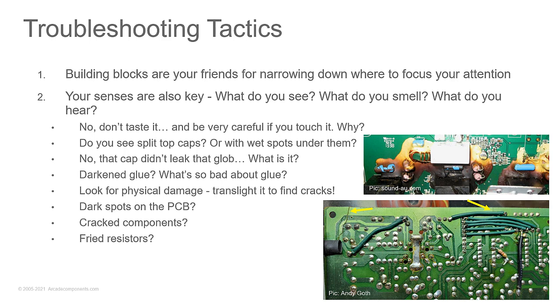Now, game boards and computer logic boards, that's very difficult to do because those are typically high quality fiberglass circuit boards. When you're dealing with monitors, you're dealing with a lot of that compressed, cheap phenolic circuit board, and the circuits are laid down with epoxy and it's not very strong. So it's very easy to lift or pop a trace off of those using too much heat or physical force. You have to be really careful so that you don't damage those. But that's why there's glue.